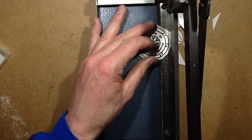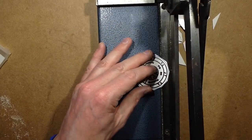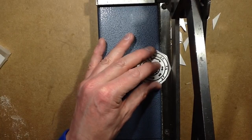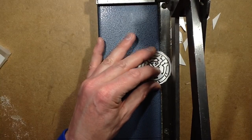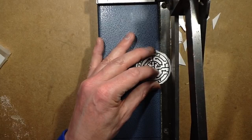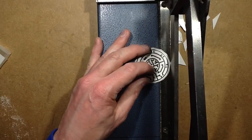And before I put the components on, I shall finish cutting this round. I'm just going to crop as much as possible in this guillotine, because it's so much easier than using hacksaws or Dremels or anything. It produces an absolutely super crisp line in printed circuit board laminate. It's a great way for trimming it. It produces a very clean line.